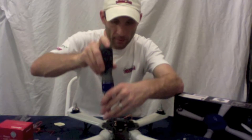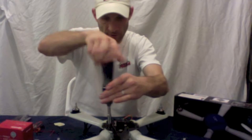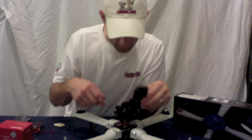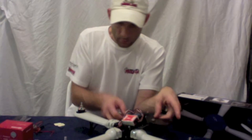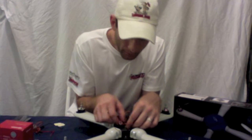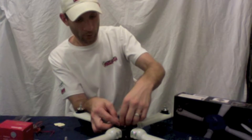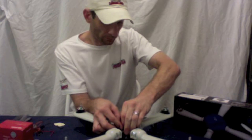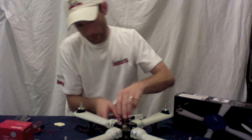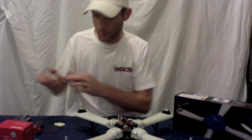What we need to do is remove this top lid — just a couple screws here. Now we've got our receiver. We've got this wire that comes off of three channels: your throttle, aileron, elevator. We're going to pull all three of those off. Pull off our FC450 because we're no longer using that, and put this over to the side.